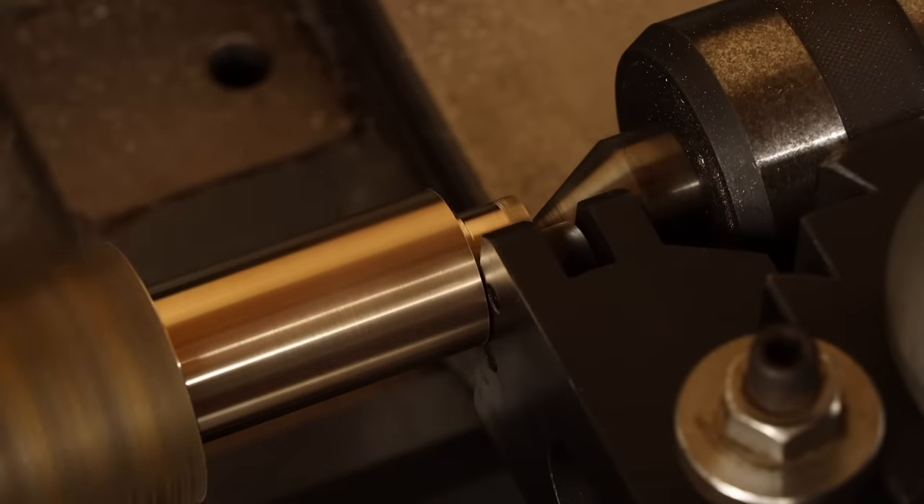Now that the arm rod and sleeves are finished, let's make the parts that hold them together — the spindles. We'll start by turning down some stock and sanding it to size for a perfect fit with the sleeves. I'll be able to economize my setups by making the two spindles from each end of this stock. We'll start with the threads. One of the biggest advantages of single point turning is the ability to fine tune the thread clearance to the mating part — in this case, the brass knobs we turned earlier. Before we flip this around, we'll also turn down and polish this shoulder. Over on the mill, the collet block makes another appearance. The positions of these drilled and reamed holes are pretty critical, so it's important to take our time here. The last bit is to split this in two and finish the end to a nice radius with a file and emery cloth.